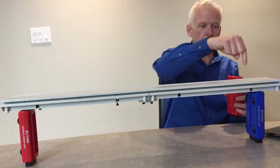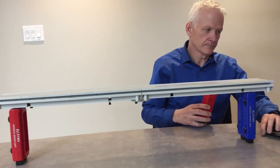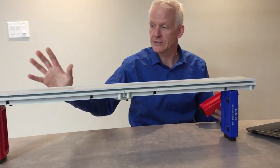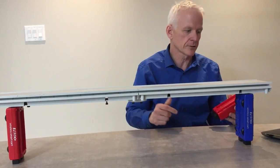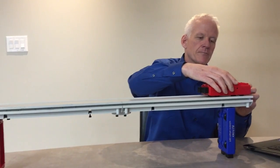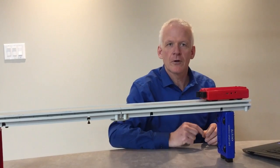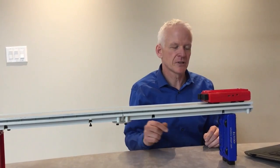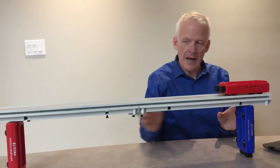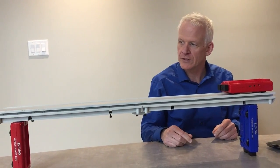What's going to measure is the vertical force being applied down by the bridge. I've zeroed the whole system through the software, so there are no forces now being measured — it's a zero force being measured by both pillars. I'm going to put a cart on top here and I'll be able to measure and monitor the track and motion of the cart, because there's an optical encoder in that cart that tells me exactly what the position is. As the cart moves along the bridge, the force sensors, each one of them simultaneously, is going to tell us what the respective forces are.